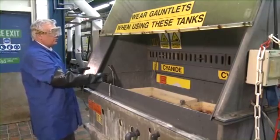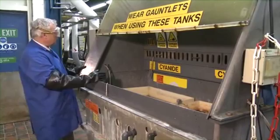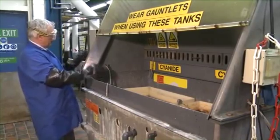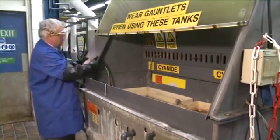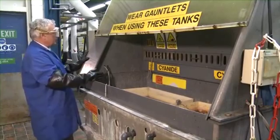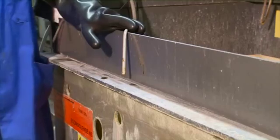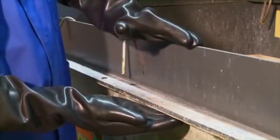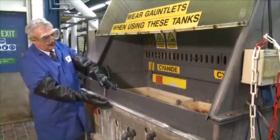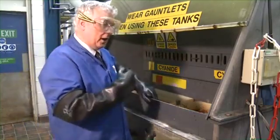The modifications we made to this fume cabinet were relatively simple and straightforward. We fitted some side baffles. This is the left hand baffle and it goes all the way around the side here and around the back — this reduces the amount of eddy currents and hence the amount of spillage that could occur at the edges. We also decreased the opening by this much, which helped the speed of air and removed any vapour from the breathable zone of your face.